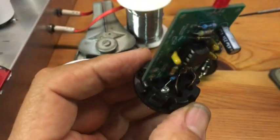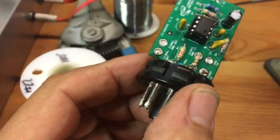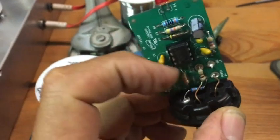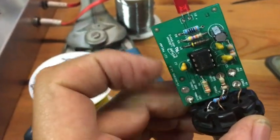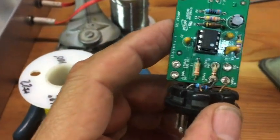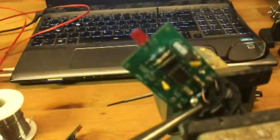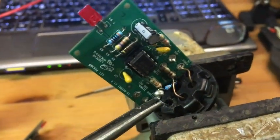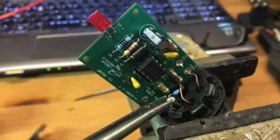Here's the next one. Our problems revolve around that little wire going into that pin there - look at that glob of solder coming out of there. You think that's soldered good? I just pushed it down in there. It's just a glob of cold solder on a wire, so I'll fix it and then we'll see if it works. It's just a glob of solder on a wire.